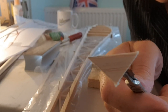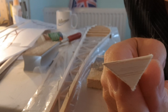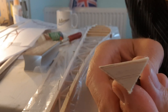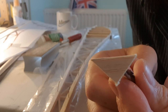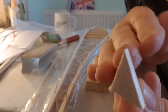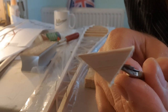The corners are 90 degrees and the grain has to go from side to side — not down one of the long sides and not down one of the 90 degree sides. Otherwise it'll just split. Very important: the grain runs down the longest side, opposing the corner. Not sort of this way or that way.